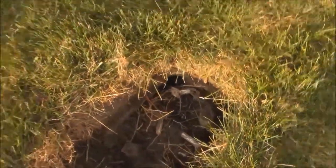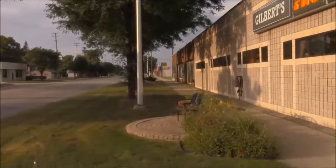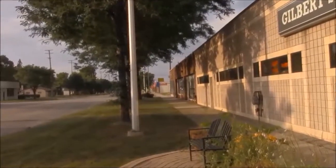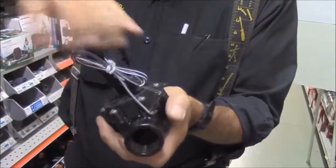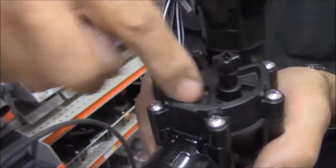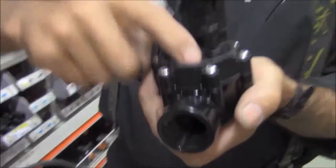We turn this on and you can see the gear drive heads come on down the road. Or you can use this little bleed nipple here — just undo it a turn or two and water will drip out, which also fires the zone. So I don't need anybody to be home to fire a zone on a sprinkler system. I can go out, find the valve box, turn a few of these on. Try not to lose that little screw — they're hard to come by.